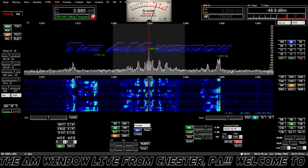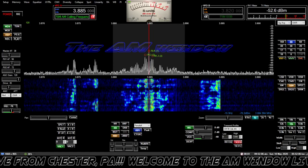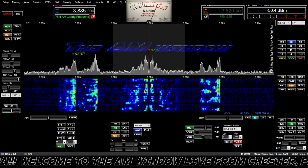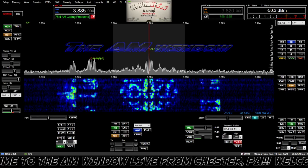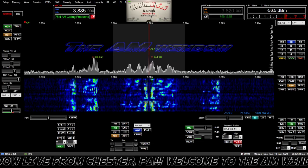So he was wanting to get back into ham radio and wanted me to help him. I said, well, the first and foremost thing we're going to do is create one heck of a ground system, because you're going to need it here. The unfortunate thing was we couldn't go very deep with ground rods. We had to slide them in at an angle, because we kept hitting that dang rock up there. But we finally got it all put together. So hopefully if you ever take a strike on the antenna up there, it'll just direct it all to ground and not come into the shack. Anyway,